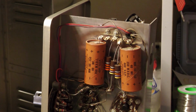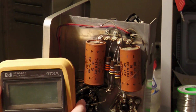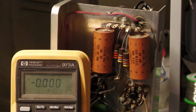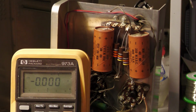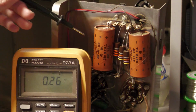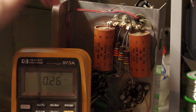So, and now I will show you something very interesting. I will use my multimeter to check this capacitor, and let's see what we get. So I will put my multimeter right here. I turn it on. Let me readjust the camera a bit, like this. Okay, pretty good. And now let me put it into the capacitance mode. So there we go. And now let's see what we get. Okay, so now it's in nanofarad. So what we expect is actually 40 microfarad, because the capacitor is rated for 40 microfarad. You can see it here and here.